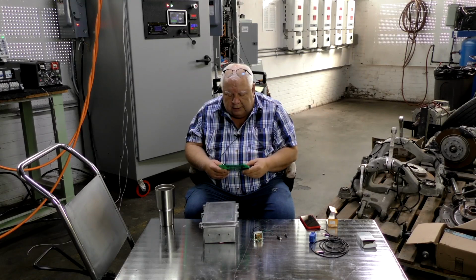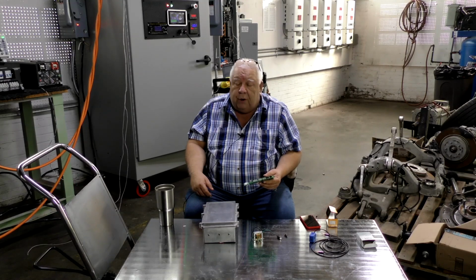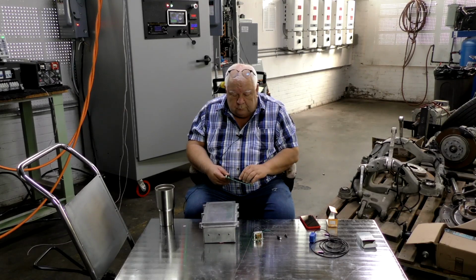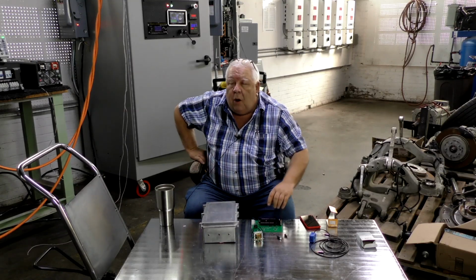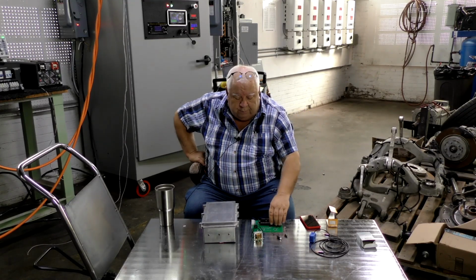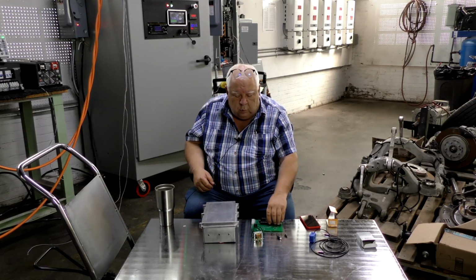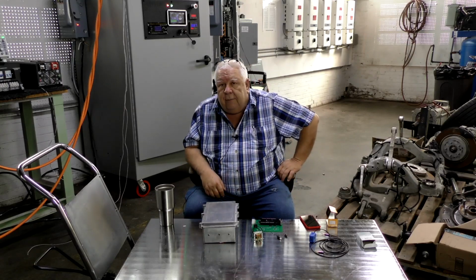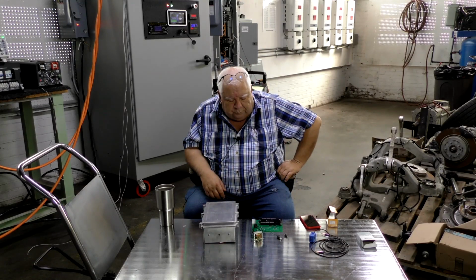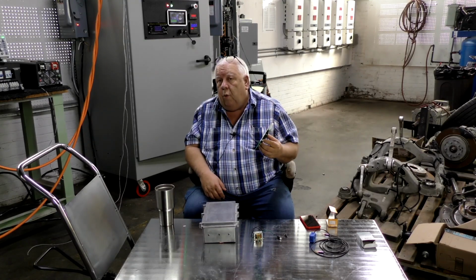We'll ultimately probably get a version of our display working with this if you just like pretty lights and stuff. But for us, we're going to use it as the input power measurement for a peak shaver or a time shift device. This being wireless, we'll also go out and get a time mark, and so we can do things by time of day and so forth to handle some of those sorts of things. So this is a piece; I can't really do a peak shaver if I don't know what the power load is.